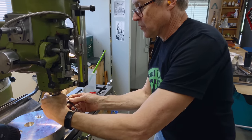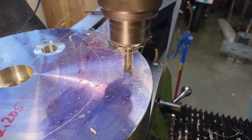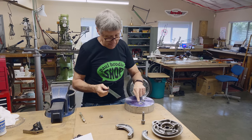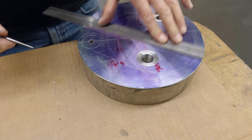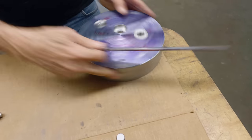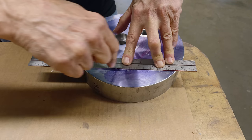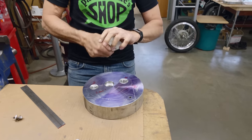I'm just going to put an 8mm hole through and then I can always make it bigger later. Now we have to scribe a line between this circle and that circle — it's called tangent. That's our final shape on the outside. We'll see how long this takes to hacksaw — I'm hoping between 15 minutes and half an hour.